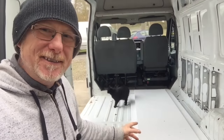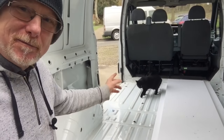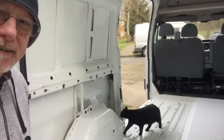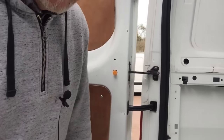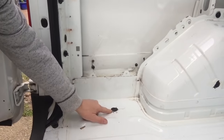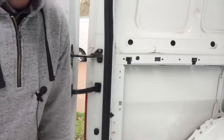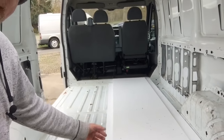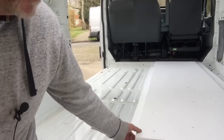So now I've got that cleared up, today I'm going to be doing the insulating of the floor, with some help from my little feline friend again, just inspecting, making sure that I've filled all the holes in. I've filled the holes with mastic — this is just about dry now. It's literally just stopped raining so I've got to be quick. For insulation I'm going to be using this 25mm polystyrene. It's only 25mm thick, which is plenty. I'm also going to be putting battens down just to give it a little bit of support, stop it getting squished underfoot.